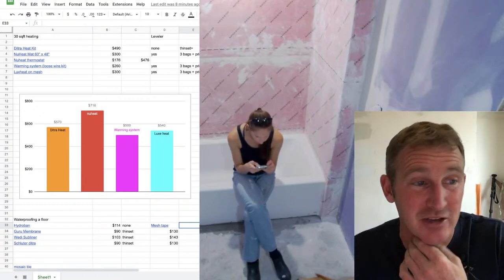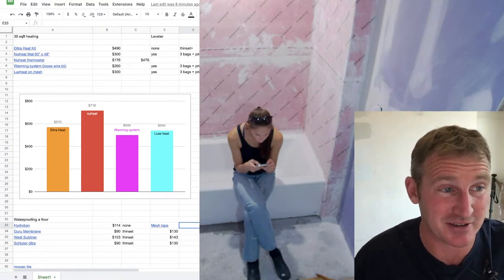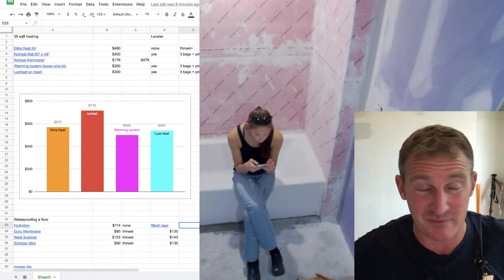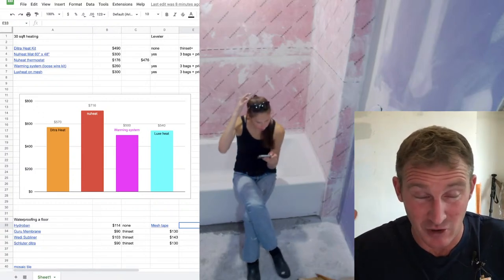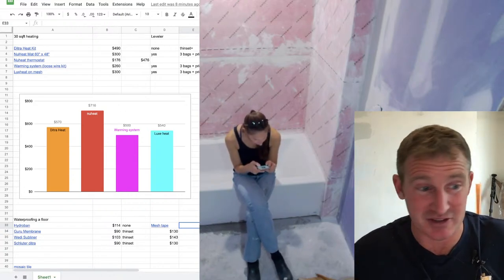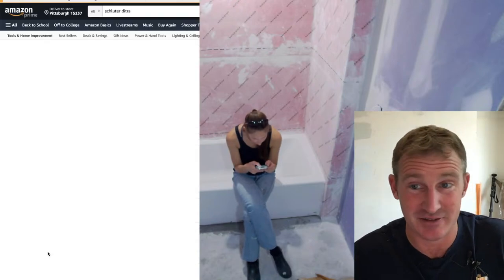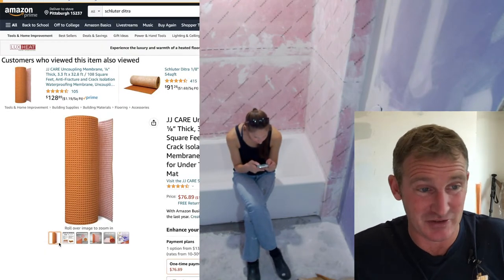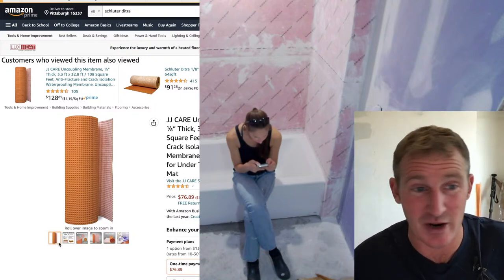The question of whether you should waterproof, I think it's definitely an important thing to do. And if you were just doing a regular bathroom floor over a wood subfloor, you'll see on my channel there are many, many videos I have on using just regular old Ditra. Ditra is a really awesome, easy membrane to install, and you can go right into tiling directly afterwards. It's a terrific way to go.